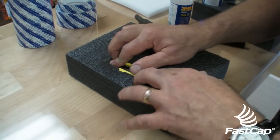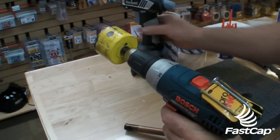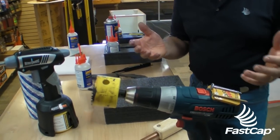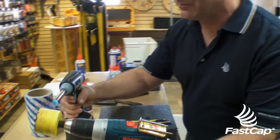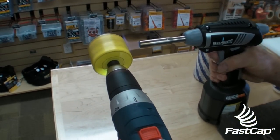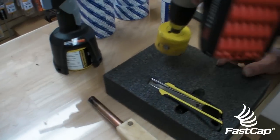All very fast and easy. The next thing is drilling holes. Let's say I want to put something round there. It's very easy to do. I take my drill right here and I have my two and a half inch hole cutter here. The first time I did this, I actually just drilled right into the foam. Then the second time - because we're all about continuous improvement here at FastCap - Alexi saw me do it and said why not just heat this a little bit? So I said, why not try it? It works awesome. So I'll turn my torch on a little bit and I'll just spin that - I'm not going to heat it too much, just about to get it warm. The reason why I'm doing that is it burnishes the foam, and instead of the foam fraying, it kind of melts it together.